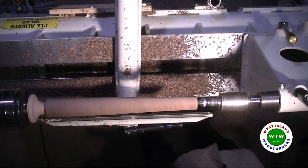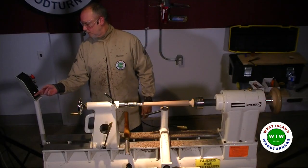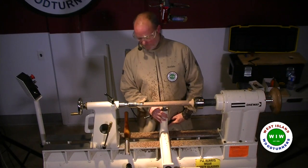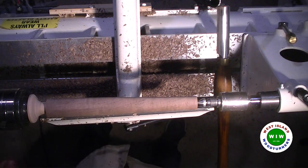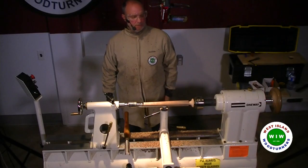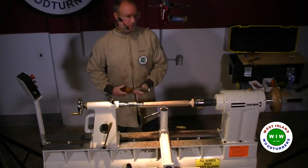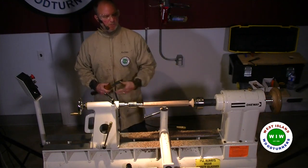Okay, so we're almost done around. Now we actually stop the lathe and let's put one on that. Wow, that's a short deceleration. We can see a long deceleration. Okay, so we just move it in a little bit here. What do you normally run the lathe at yourself when you do this? When I start the roughing, at about maybe 1800. I'll increase the speed a little bit as I get around, anywhere 1800 to 2200, because it's such a small diameter. Right? So.